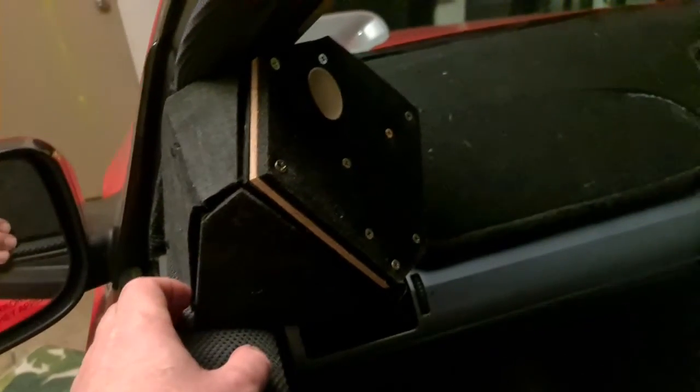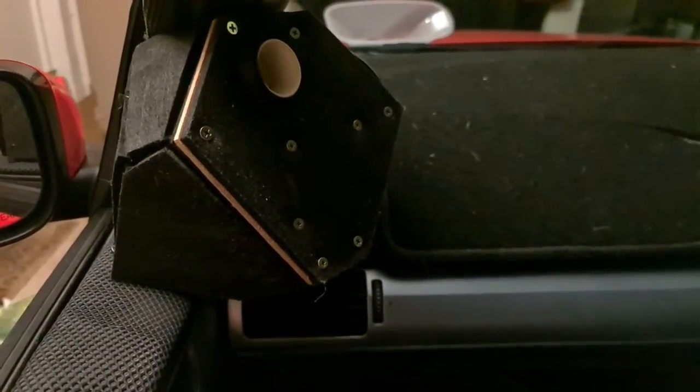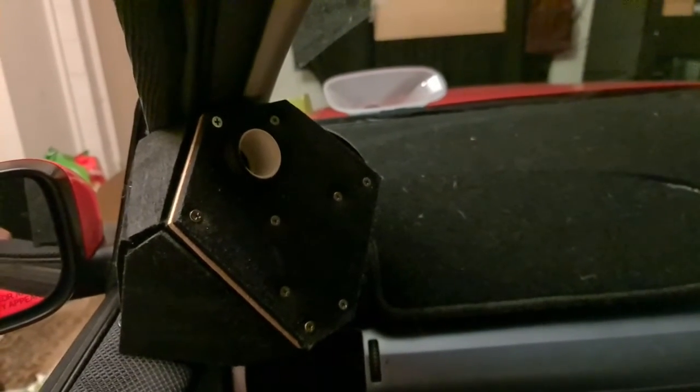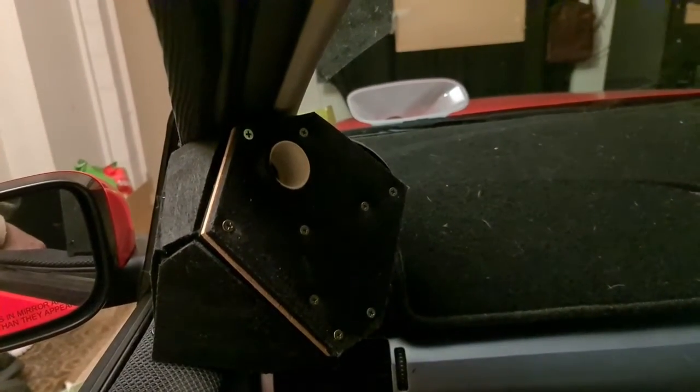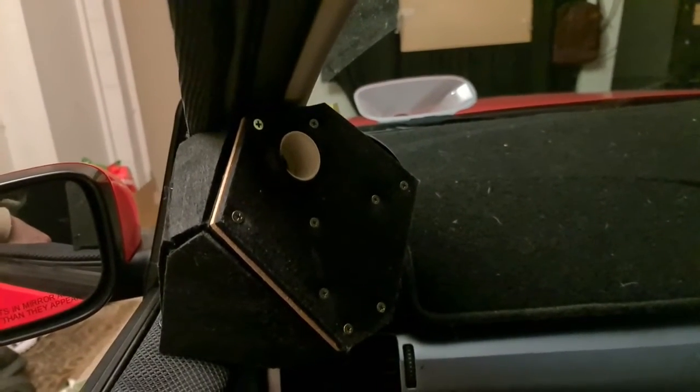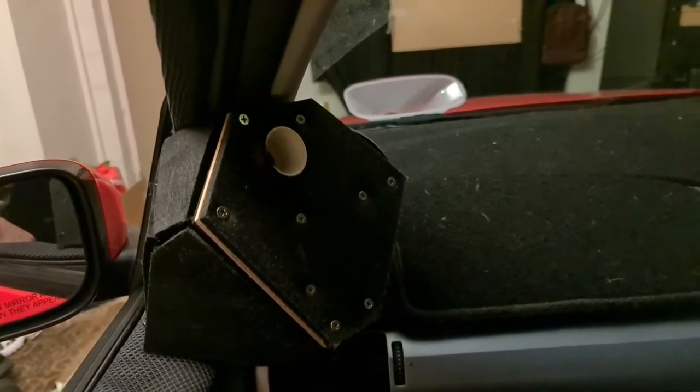I've been building this as a temporary proof-of-concept prototype, and the shape of this baffle was really just based around trying to fill the spaces. It's also acting as another kind of diffraction waveguide — the sound propagates in this direction and forms off this shape. It's good having this asymmetrical lip to prevent baffle step interactions where you'd get a lot of cancelling, and I'm hoping the direct sound is more influential than secondary and diffraction sounds.